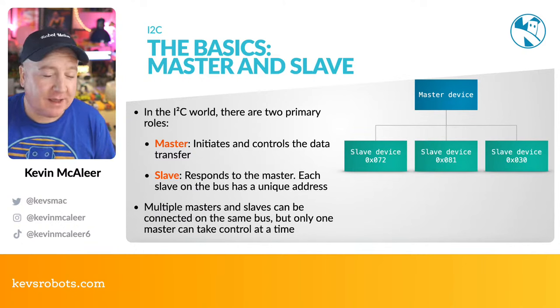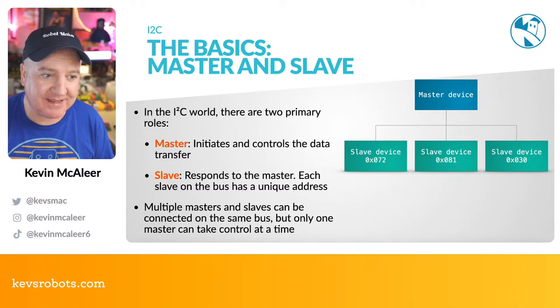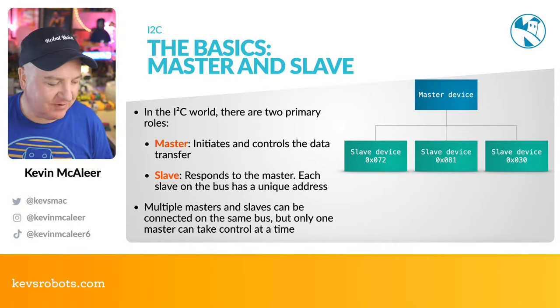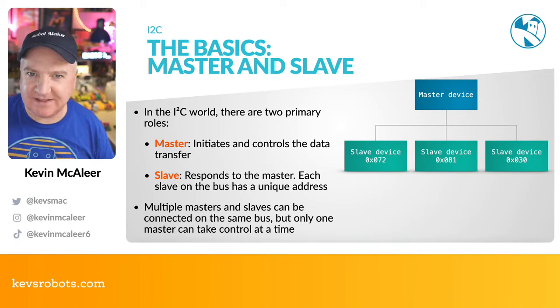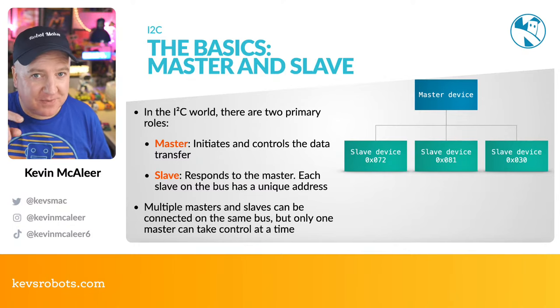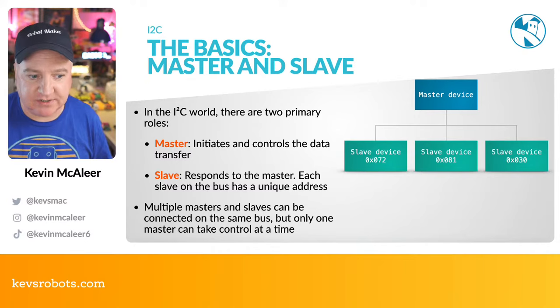The display uses I2C — I usually say I2C but it is I-squared-C. The idea is you can have a master device and many slave devices. It was invented by Philips in the 70s. You can have several masters on the same bus but usually just one to avoid chaos. The master pulses on the data line at a given clock period, with acknowledges and no-acknowledges — a handshaking protocol — and you can write to a memory address as if it's local to your processor.